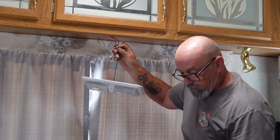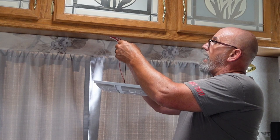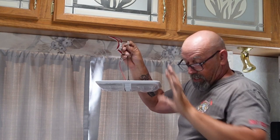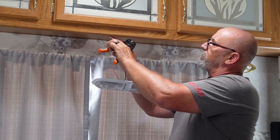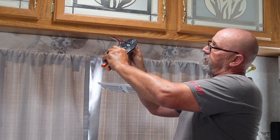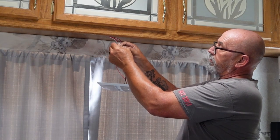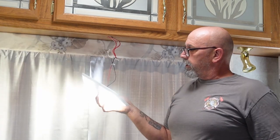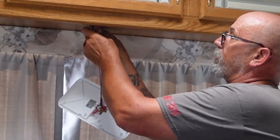As you can see, I did not get harmed. Low voltage, little stuff like this is fine. High amperage and high voltage — no, don't do that. If you're messing with your batteries or AC power, turn it off and be safe; even 12-volt can be dangerous at high amps. Crimped it twice, gave a little pull test — it stayed together. Quick test: on, off, on, off. Now we just shove these back up in the hole.